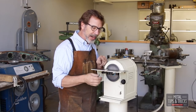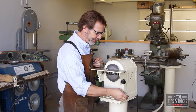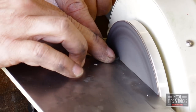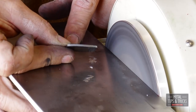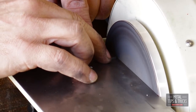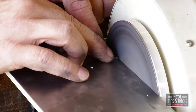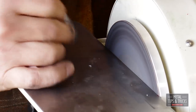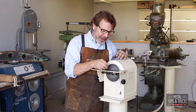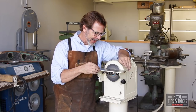When you sharpen a scraper, you're actually sharpening and making two edges at the same time. With the negative angle, I'm able to come in here, sharpen it up, and see how that looks. Because of the negative angle, I can come in and do the other side — I'm looking for the shavings — boom, sharp. My goal is to make it kind of like a roof, so I can scrape, flip it over, and scrape the other side, giving me two sharpenings at the same time.